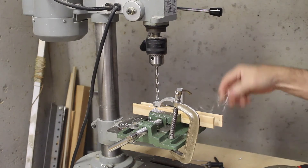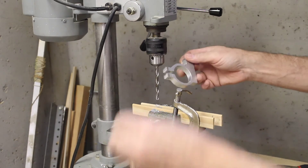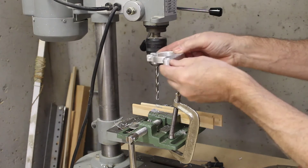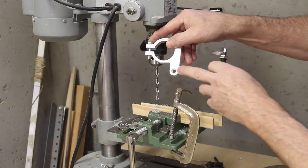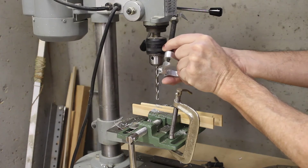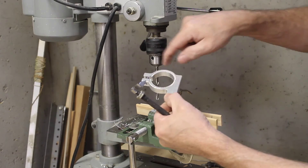It's amazing what a sharp bit can do. Nice little hole all the way through. It'll be going through this way for the lock and bolt. I drilled a little countersink and placed where the gauge screw is going in order to let the bolt come all the way through, since this aluminum is a little bit thicker than the original. I believe it'll work without having to grind off this top part, so I'll probably just leave it.